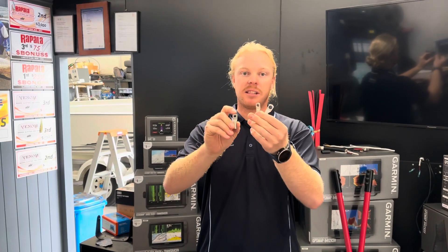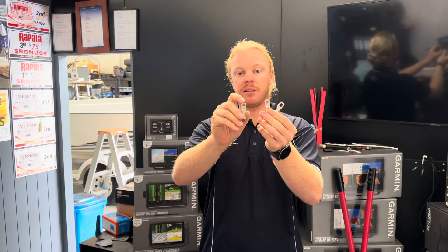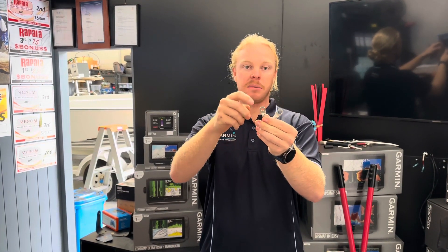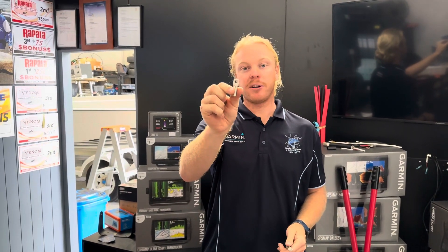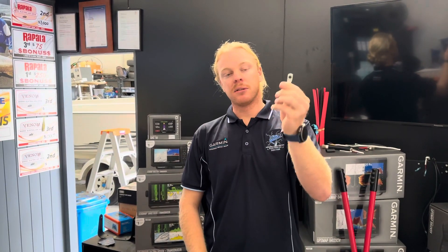So the 6mm hole on that ring there, that's an 8mm hole, that's a 10mm hole. The 6mm you'd use for most circuit breakers, 8mm will be most battery terminals, 10mm for most battery switch sizes, as well as 12mm for commercial sized battery switches.